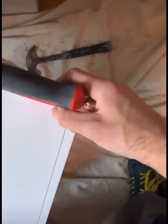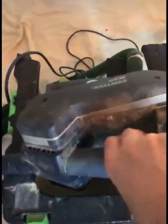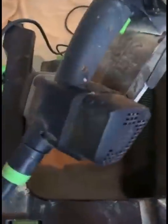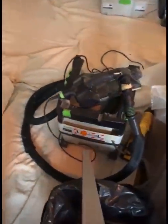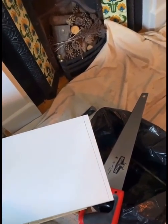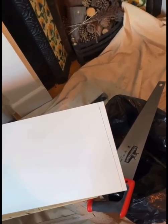I've laid it flush to the back and drawn around both ends. I've gone back to just using a handsaw for cutting most of these — I use it also as a square to mark off, mark square down the front, then just cut down. I can curve it a bit as I cut and then trim back with a Festool EHL 65 planer, keeping that plugged into extraction rather than swapping back and forth. I just saw into a bucket for dust control. I've tried loads of methods — jigsaw, rail saw — sometimes the handsaw is just the best thing.